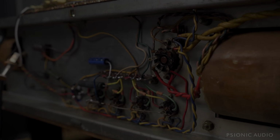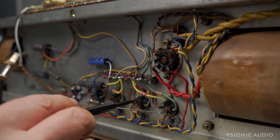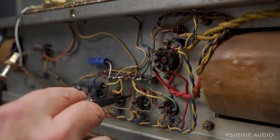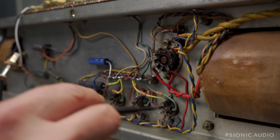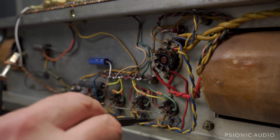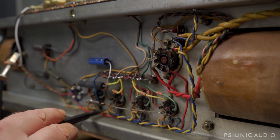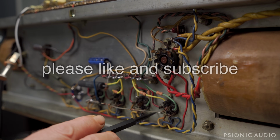I've made some really good progress here on this early 63 or late 62 AC30. The owner thought it was a 64, but I think given everything that I mentioned in the previous video, late 62, early 63 is much more likely. So here in the output tubes area, where the output tube sockets are, there used to be this really dark filmy residue all over everything, and it was a combination of dirt and old wax and some heat issues, and that all cleaned up mostly with naphtha.